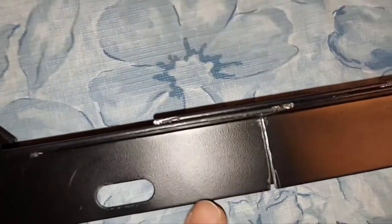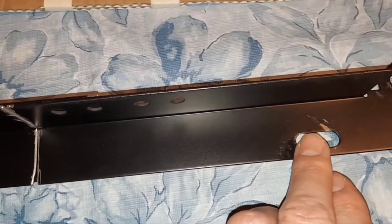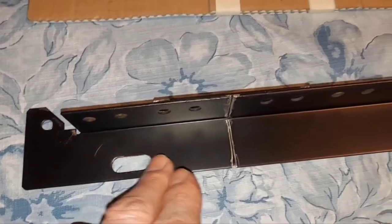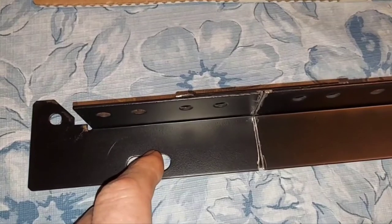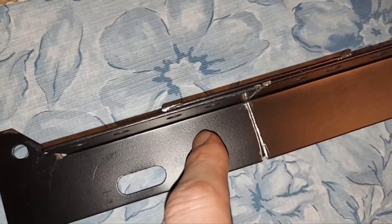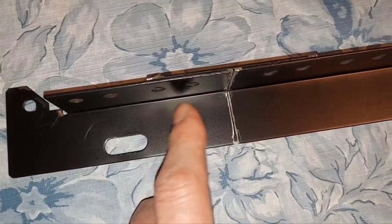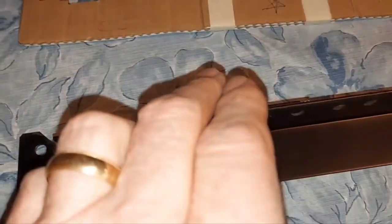We're going to put that bracket on that side, but the top — this same type of bracket — the bolts go up through this first and go into the top rail on a Donkey Kong. It seems strange, but they come from the factory with the bolts running up through here from behind and then into the top rail. So on the other one I need to put this little piece of bracket on the inside. You can't switch them back if needed because once you snug them in at 90 degrees to this piece of angle and make your screw holes, it'll only fit on one side or the other because of the metal thicknesses being on the inside or outside of these brackets.